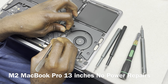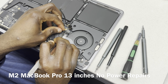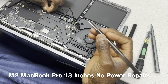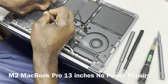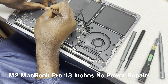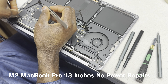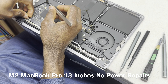Now that we know we have a short on that line, the next thing is to find out which component is causing the short. Once you find the component you address it and your repair is done. Sometimes you might have multiple shorts — you address one and then find another one. It's not common, but in cases of liquid damage, when you have multiple corroded components, that's expected.